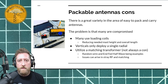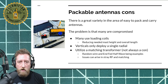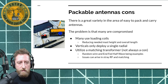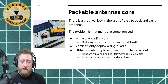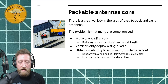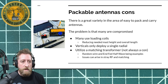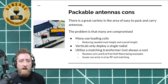Then there's another set which use some kind of matching transformer — an example would be an end-fed half wave, a really long wire antenna. We call it end-fed because the feed point coax mount is right at the little junction box on the end of that long wire. And then there are random wire antennas which use a 9-to-1 un-un. The issue I've experienced in the field with those matching transformer-based antennas — particularly the 9-to-1 un-un with the random wires — is you get stray RF back into your radio via the feed line shield. Not a big deal at QRP, but if you bump up to 100 watts and you're running digital like FT8 or JS8Call, that can have an effect on your station.